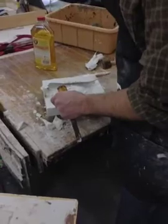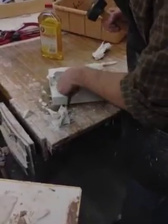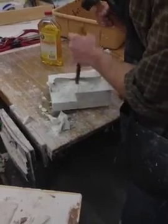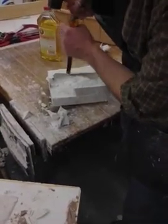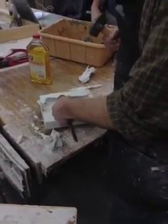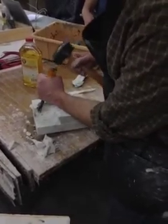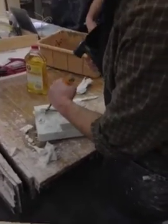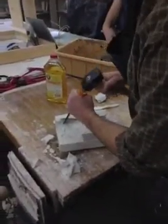See, it snapped. And I snapped it way up here. It wasn't anywhere near my cast. Right here is part of my cast, by the way. See how nice and thin that is? It's 1/8 of an inch. If I start to go in here, I'm going to have a problem with it holding together. So I'm going to come back over here, take some of those easy parts. And now I'm coming over, I can hit it like this, it'll come off that way.